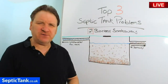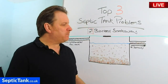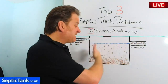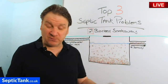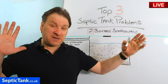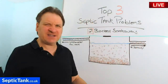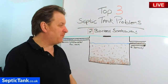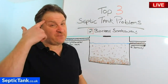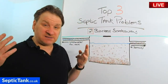Now, they charge 150, 250, 350 quid, and it's a living for them. But they won't tell you that it's no good, right? It may make you feel better that you had your tank sucked out and you're firing high-pressured water into it. But in reality, what it's doing is compacting all the fat and the grease and the sludge in the soakaway. It doesn't clean it out at all. It just makes the problem worse. It makes the septic tank emptying companies richer and it makes you feel better. But in reality, the soakaway still won't work.